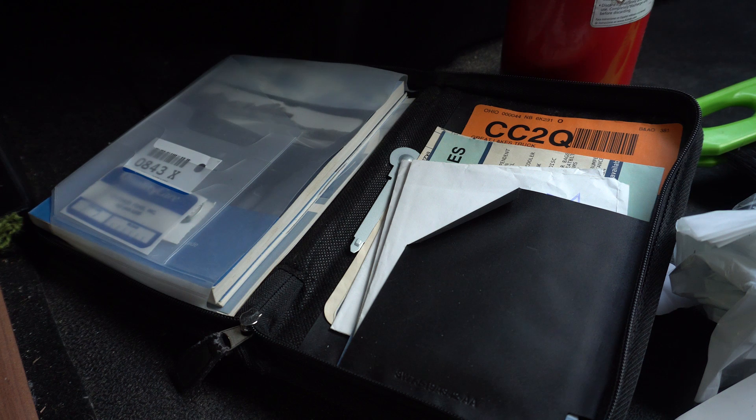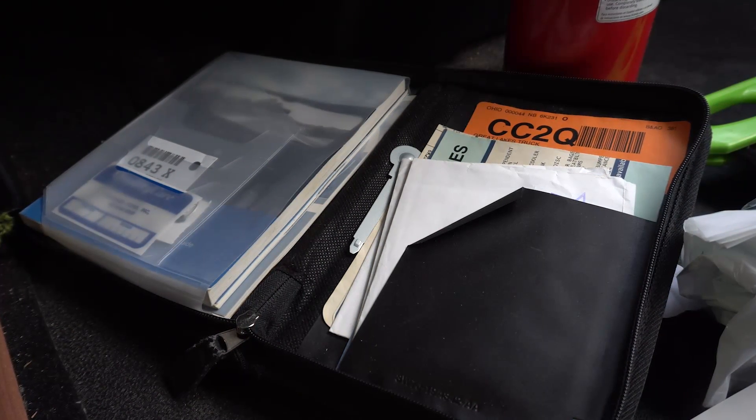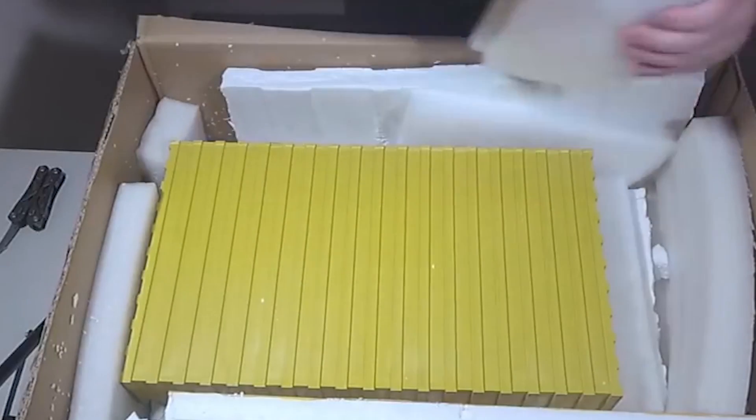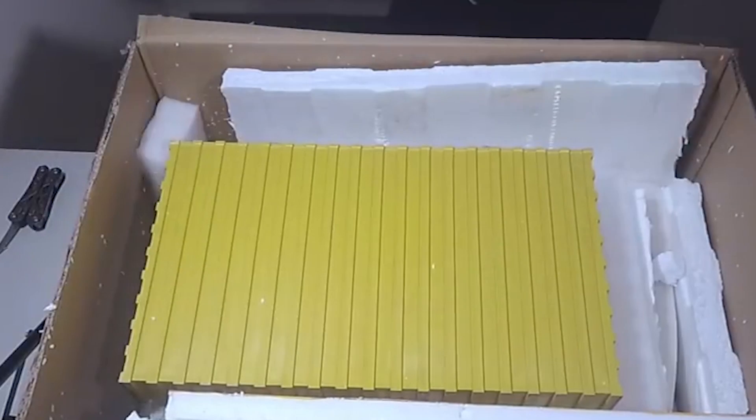Well, I can't find the battery information, however most batteries come with some type of documentation, or if not, you can look it up online from the manufacturer. They're all a little bit different — like a 12-volt battery you might charge to around 14.2 volts, or there are settings for how long they should be in a float charge, something like that.